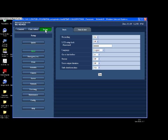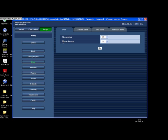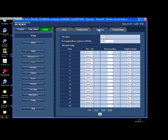We're going to go into setup, and the first thing we want to do at the actual recorder is go to Event. Under Site Alarm, we want to have this turned on, so we're telling the recorder to accept these alarms coming in from the camera. Here we've got the port number which is 1818 — we'll see that on the camera as well. You can change this port but you can leave it at the default. Come down and hit Set.